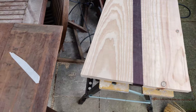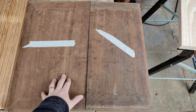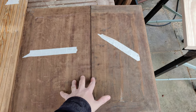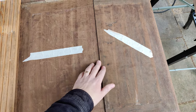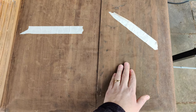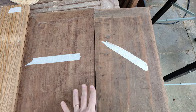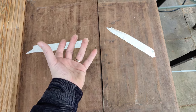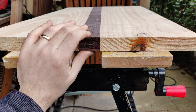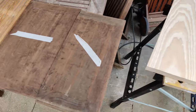So it's time to start talking about the top. My original plan was to use these two beautiful bits of what I assume is oak. I was given a whole pile of them and actually used two for my previous guitar build's top — I really like how it looks, with all these rays and darker stripes. But I can't really use these on this one. Up here they're about a centimeter thick, but this one gets really narrow down here at only about 9 millimeters. By the time I flatten it out, it might only be 7 to 8 millimeters — which isn't thick enough.